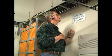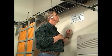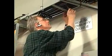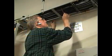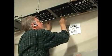The second technician should be at the location where the target cable needs to be identified. It's recommended that this technician wear a hands-free headset while using the mobile phone, as both hands will be needed to make the test. The technician operating the instrument can now communicate with the remote technician over the cell phones. The remote technician begins gently tapping the suspect cables in turn, while the instrument operator listens for the loudest and clearest sound in the headset, as well as movement of the displayed bar graph. It's important to use the same amount of force when tapping each cable — a light tool like a pen or the handle of a small screwdriver works best.